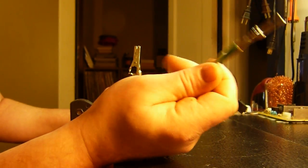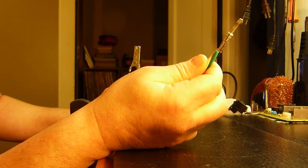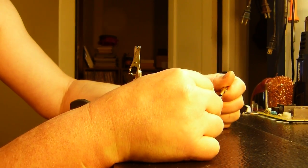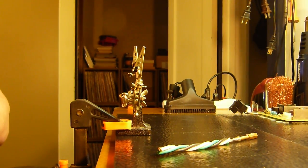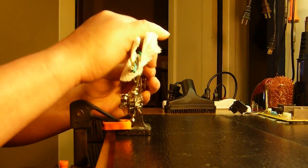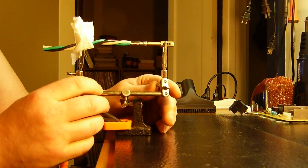Okay, this is a wire I made for somebody to show them how to do a banana plug. It's just a piece of wire, how to put three wires onto a banana plug. You can see, look at the solder, see? Really nice. You always use another connector that it's intended to do, to hold it, right? And always put something here, it doesn't have to be much, like a piece of paper towel, put it on like that, put your wire in it, so you don't crimp your wire, hold it, and look, you see? You can solder that, that's not going to move.